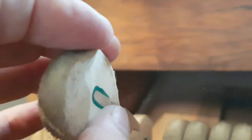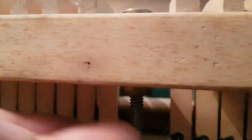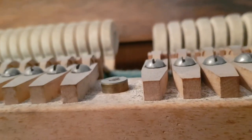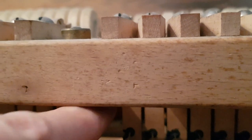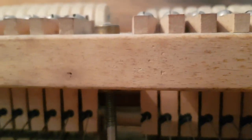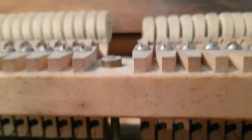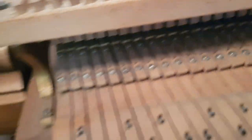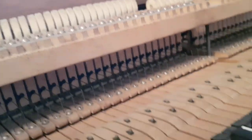The regulation on the action isn't bad at all. These screws here — when I came to the piano they were loose and halfway down, which is not a good idea. You need them as guide screws: if you ever take off the top action you need these as a reference so you know exactly where to place the action when you put it back on. That's not something you'd move if, for instance, you're working on the keys.